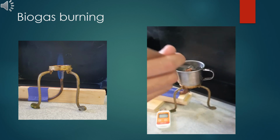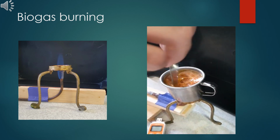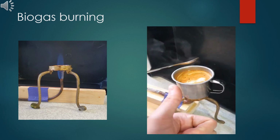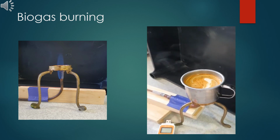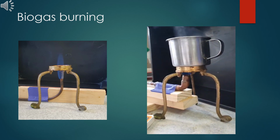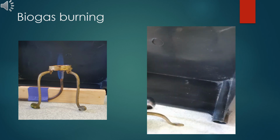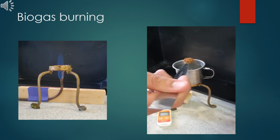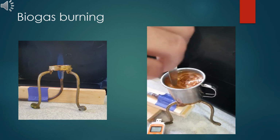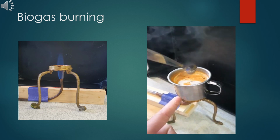In our little side experiment, we examined the impact of diluting biogas with an addition of CO2 and N2. We found that the low methane content in the biogas requires a higher flow rate to sustain a flame. CO2 in particular seemed to absorb more heat than the N2, meaning that a high CO2 content results in an unsustained flame. Additionally, while extra N2 caused flame detachment, this issue could potentially be resolved with improved air mixing. These observations indicate that further experimentation is needed to fully understand these effects.